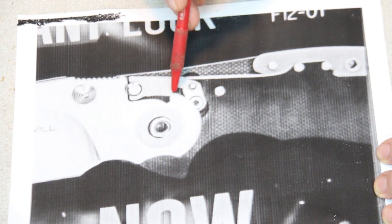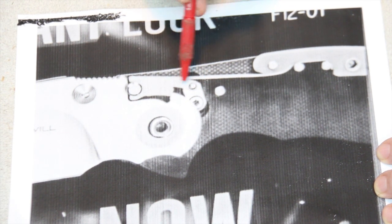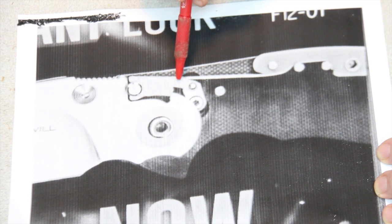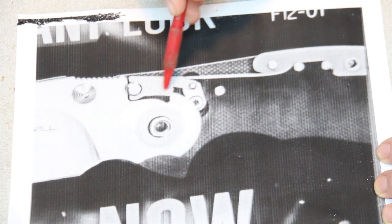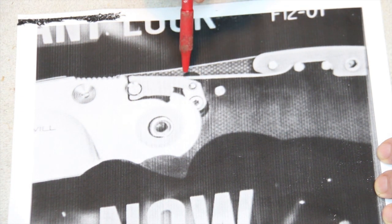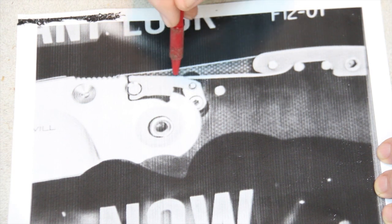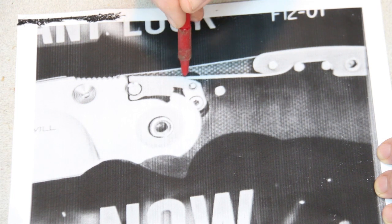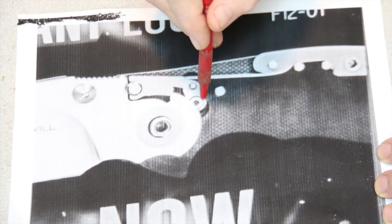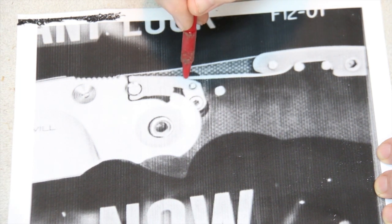The lock bar has movement constrained by this pivot pin, so it can only travel so far. To move, it has to be able to rotate here — so this has to be a movable joint to have the play. What would keep the lock bar from having too much movement is the way this extra tail piece is shaped. You can see there's a routed-out canal, so this lock bar is alongside the blade and its travel is restricted to only being in this channel.